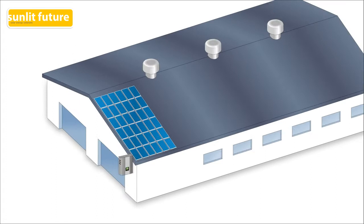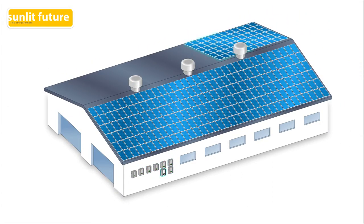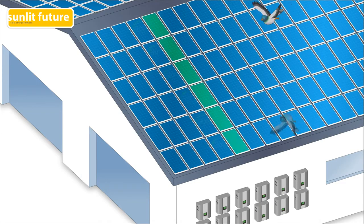String inverters have a limited power range, and large solar systems need several inverters. This system is used all over the world and has proven to be the most cost-effective system, but there are a few drawbacks. The first major drawback occurs when a part of the solar panels are shaded. When one or more panels produce less energy, the power output from the whole string is reduced to the level of its weakest panel. This can drastically reduce the power output of the whole system.